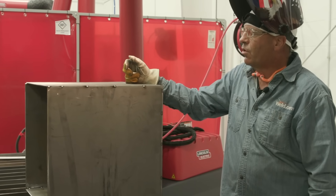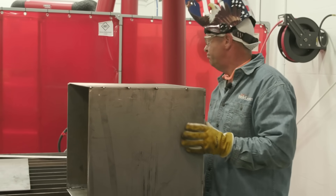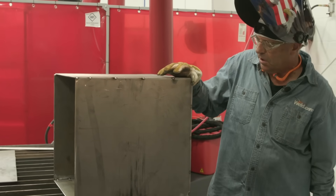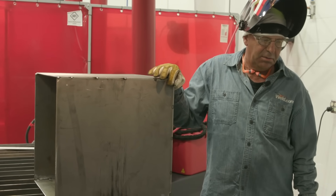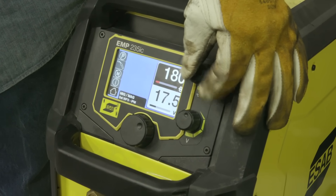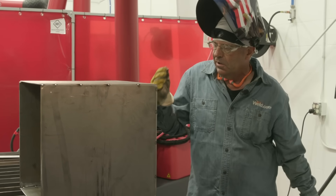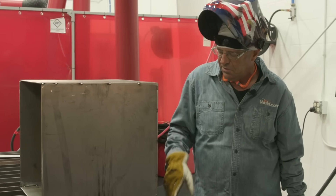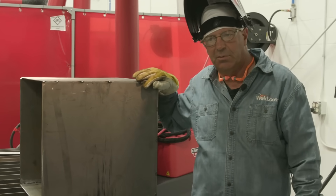We're all fit up, outside corner to corner — nothing critical, it's just a cooling tank, but it's a practical build, and I'm ready to weld. Because this is an outside corner, I did leave myself about a 16th of an inch gap everywhere. I'm probably going to turn the volts down to about 17.5 and the wire feed speed down to about 180. I just want to kind of soft butter this in here. I'm going to try to make full seam welds, the full 18 inches. I'll stop near the corners and I might even TIG weld the corners, just to make them seal up.